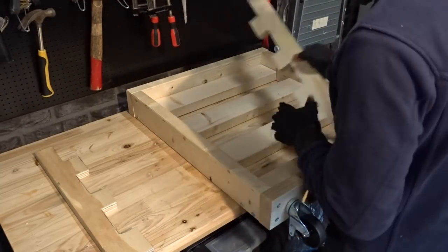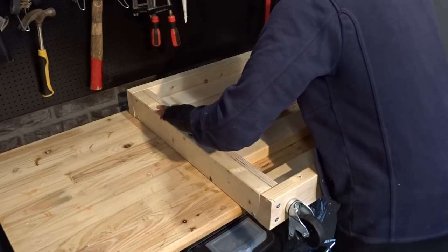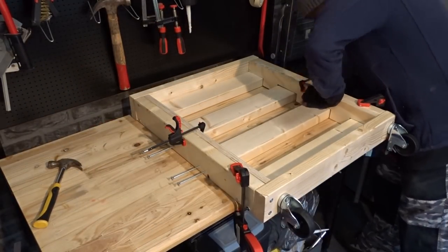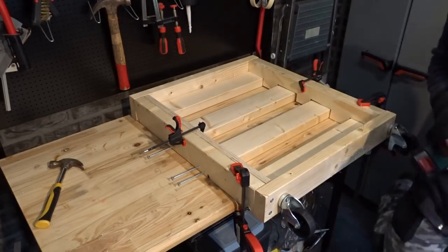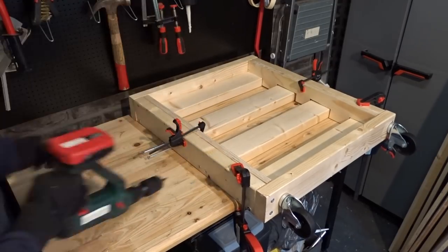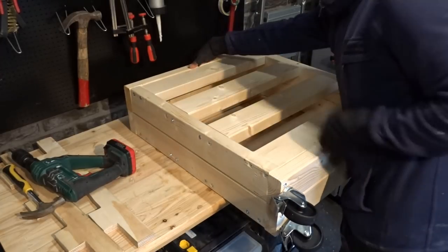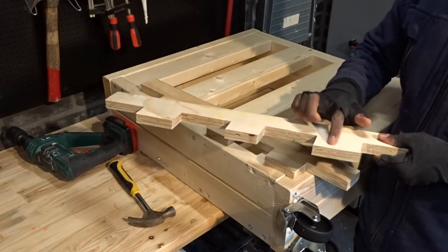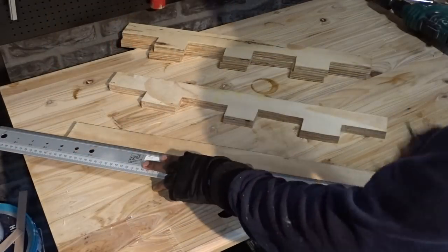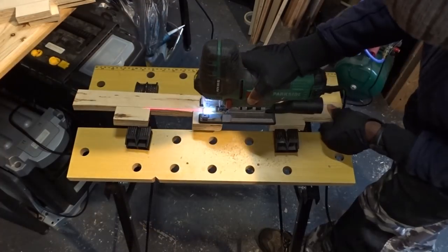Now that we have been testing the arms, it is time to complete the frames. As you can see, I am using some templates that I have been cutting in order to insert the middle piece of lumber and find the right placement. I will also advise you to use exactly the same template on the other boards. Now it is time to screw them in place. I was quickly done with both sides. I am now going to remove those three hooks, then use the remaining slats to insert on each side of the frames. Those slats will be the ones I will use to attach the arms into each frame using the hinges.